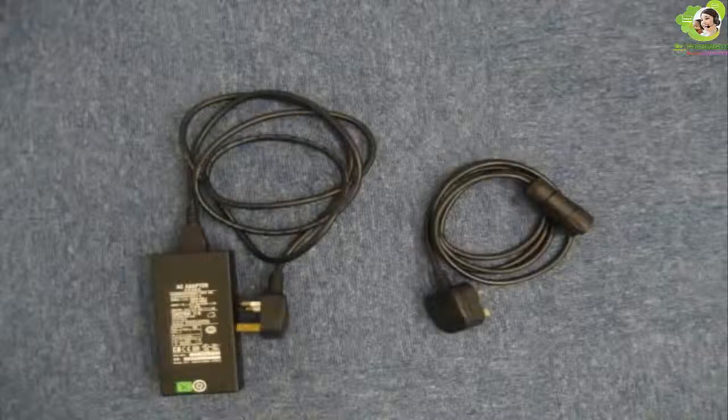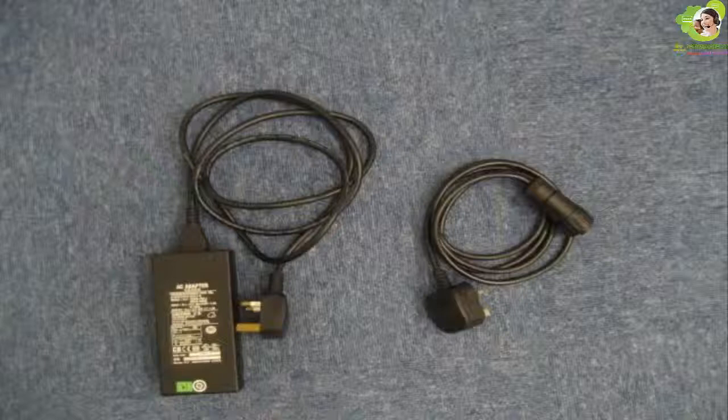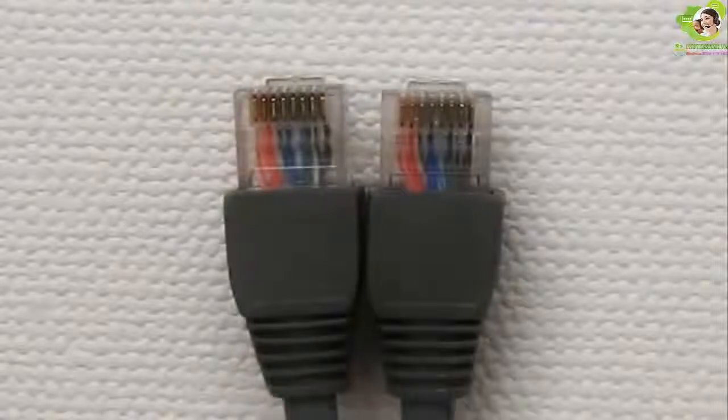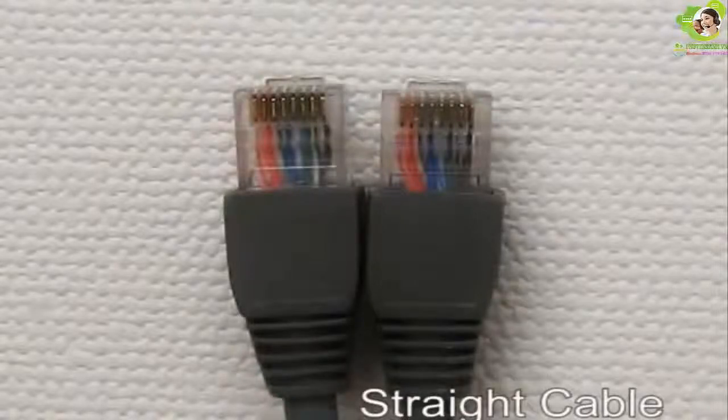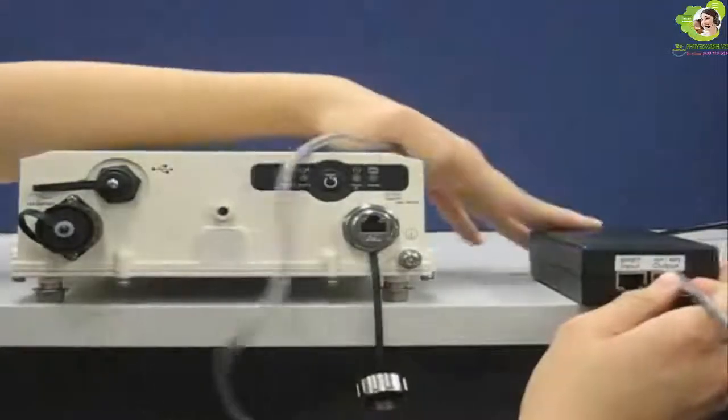After going through the above steps, we can now power up the A8 base station. There are two ways to power up the base station. You can either use the PoE injector or a separate AC power cord which has a weatherproof connection. If you use the PoE injector, a straight cable and NOT a crossover cable must be used to connect the Ethernet port and the PoE injector's APBR output port. A weatherproof kit is necessary for the Ethernet connector cable if the A8 main unit is installed in an outdoor environment. Plug in the Ethernet cable into the A8 Ethernet port.